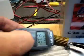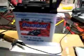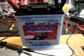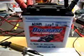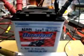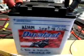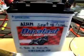And the resistance is hot, I mean, it is working. So I'm going to do 1 cycle now. I'm discharging it, and tomorrow I'm going to recharge it again. So in the meantime, with this 1 charge and discharge, the plate is going to form a little with a little bit of the acid, and I will dump out the acid again, rinse it, and put in the new distilled water with the new alum, and see where we are.